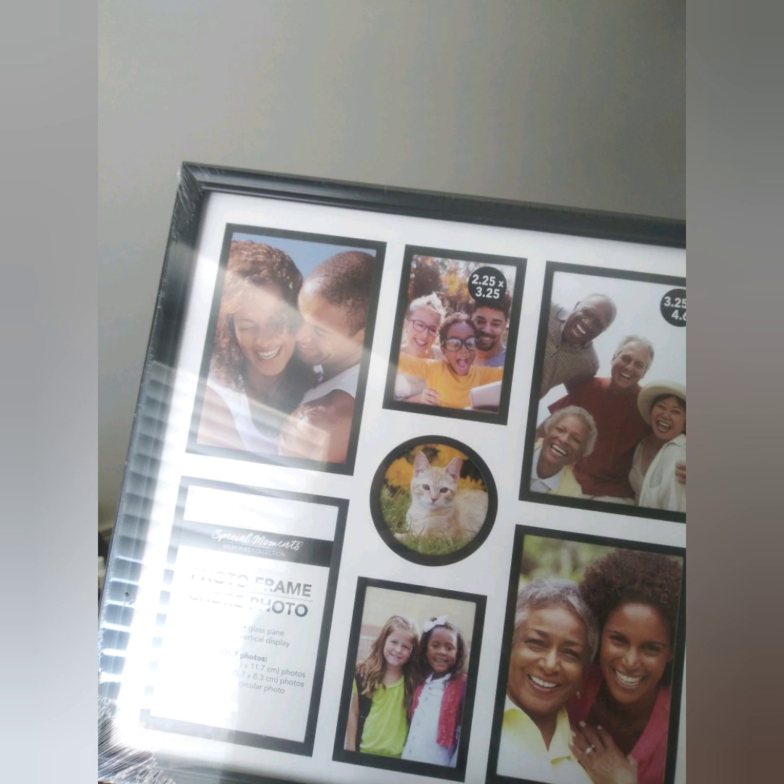Now when it comes to painting this, the frames have a plastic finish — not wood like normal picture frames. That being said, we had to buy a plastic primer. We'll show you exactly what we got and we can leave a link in the description below to show you exactly which one to get.